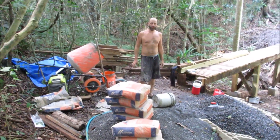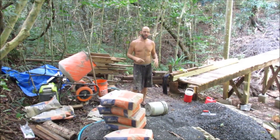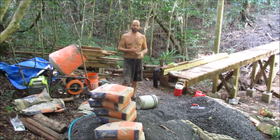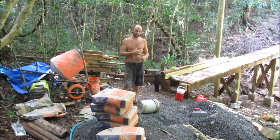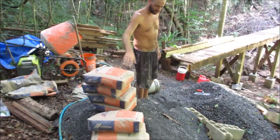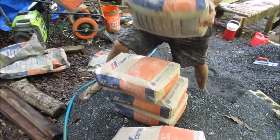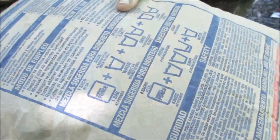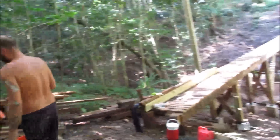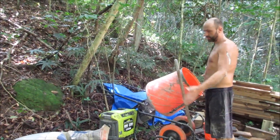When it gets time to mix the concrete there are a couple of choices. You can get a ready-mix truck to deliver it, which is the easiest, but in this location there was no way we were going to get a ready-mix truck down here. There are also bags of Quikrete that are already mixed with sand and rocks and have the right ratios. What we're doing is using just cement, mixing it with sand and rocks — the proportions are on the back of the bag — with how many bucketfuls of water, sand, and rocks you need. I'm using a little electric mixer that we picked up at Home Depot, so we also have an electric generator so we can mix concrete wherever we're going.